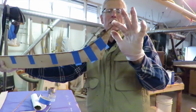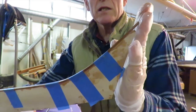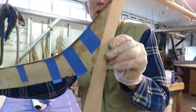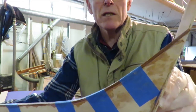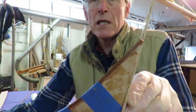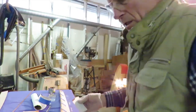This is where we repositioned it - we had the top edge down further, so we slid the sapele up farther because the backrest is going to come in like this. Now we have enough sapele sticking out that we can bevel and sand it to have the perfect angle to meet the backrest without a break between them. You can see the sapele sticks out farther than necessary for the backrest - that will look a lot cleaner. We have a lot of extra at the other end. We could have stuck it up farther but we'd have more sanding to do, and I always try to avoid extra sanding.